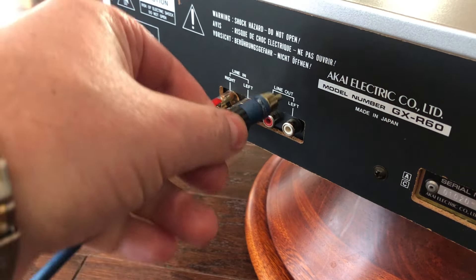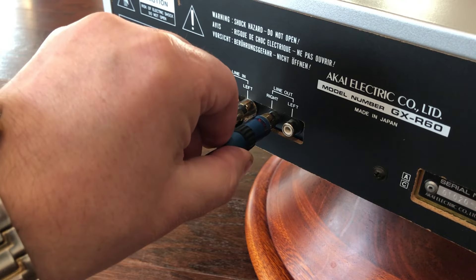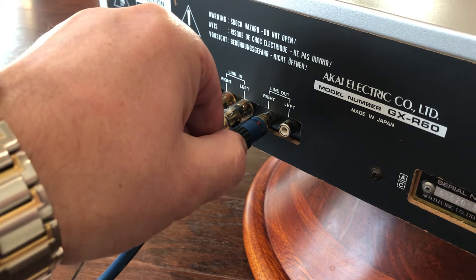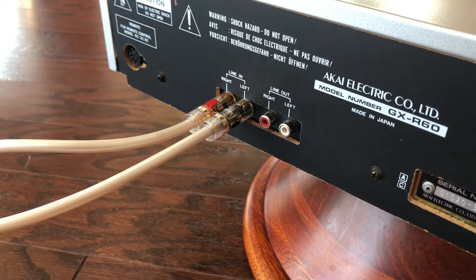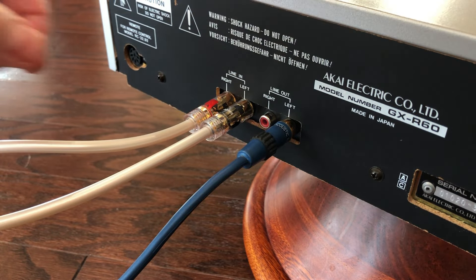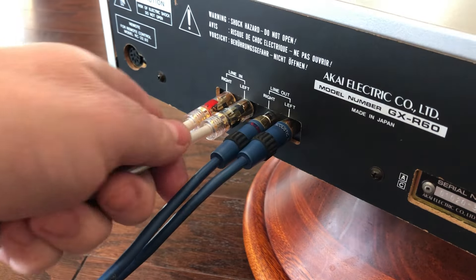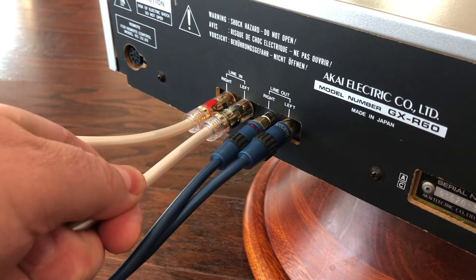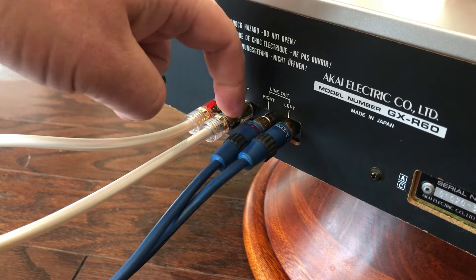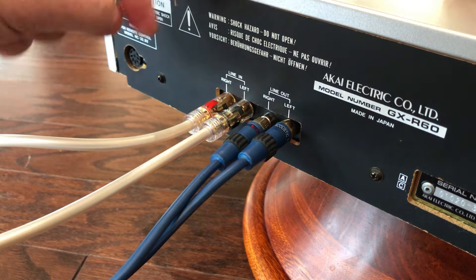A good example of this is this aftermarket cable — it's an advanced cable, but it comes very stiff. You can see all shakes together, so I don't want to push too much, not to damage anything. But if one channel comes easily and all are connected together like that, sometimes you need to disconnect the middle cable. People can take one cable and try to pull — don't do it. Otherwise you will break the connection inside the RCA itself. You will break the wire, the signal wire, which is very bad.